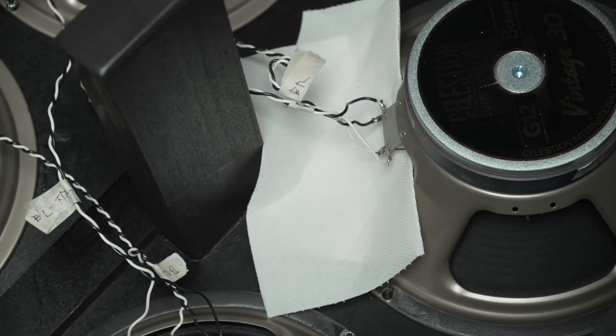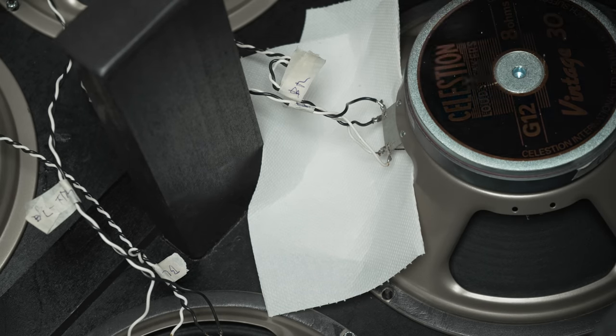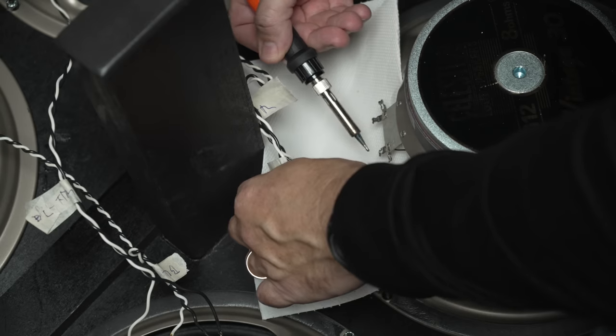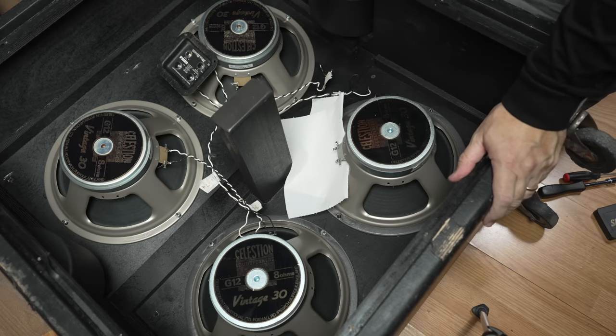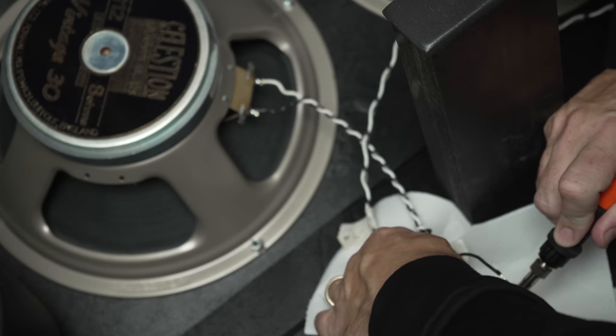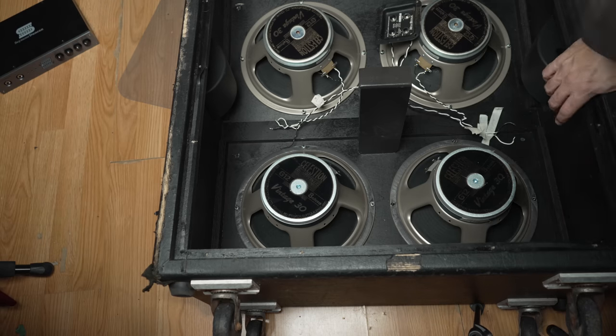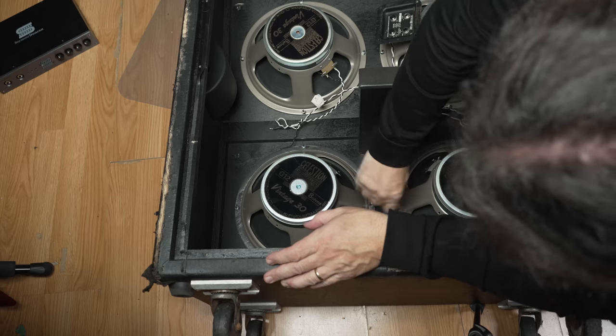The soldering iron's heated up. I've put a little bit of paper towel under here so I don't get any solder dripping onto the speaker cone. Just heat and pull — it's pretty simple. I'm going to tape off those cables to the side so I remember where they're supposed to go. I'm not a solder jockey, and I'm sure some of you are wondering why I need the paper towel. My soldering skills are just not that good — I actually had a little bit come off onto my skin. You've got to be careful, and it's really critical if you're not well experienced that you protect your speaker cones.